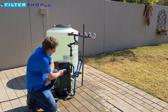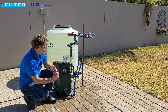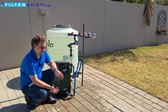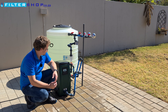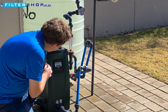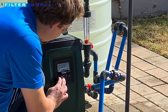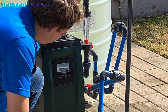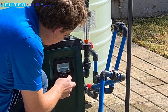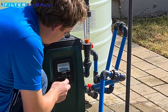The nice thing with the EasyBox units is they've got a very nice control panel that gives you an incredible amount of information and lots of options. It isn't the most user-friendly thing, so there's a bit of a learning curve, but once you've got the hang of it there's actually a lot you can do with it. Let's first see what pressure we're set to — hold Mode and Set for three seconds. It's set at three bar pressure. Let's start from a lower pressure and see how low we can go.